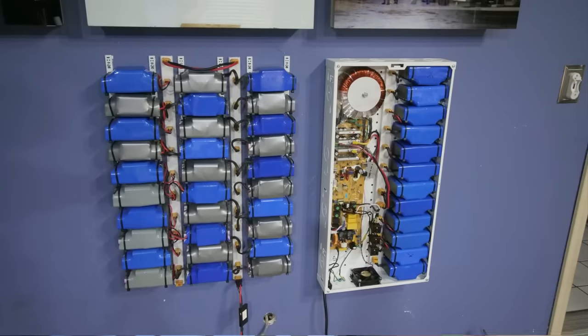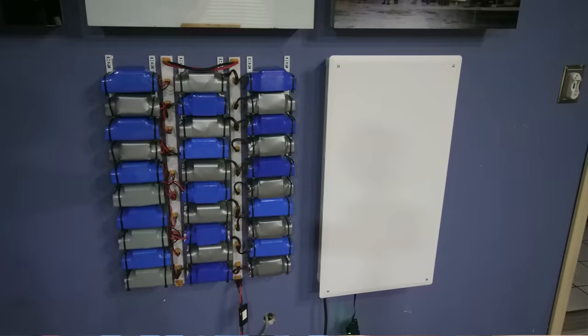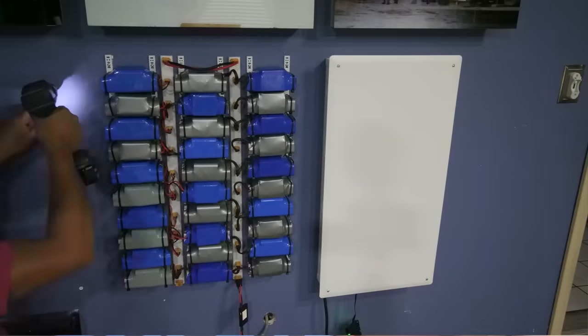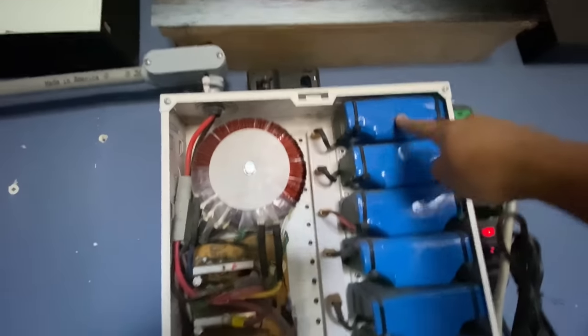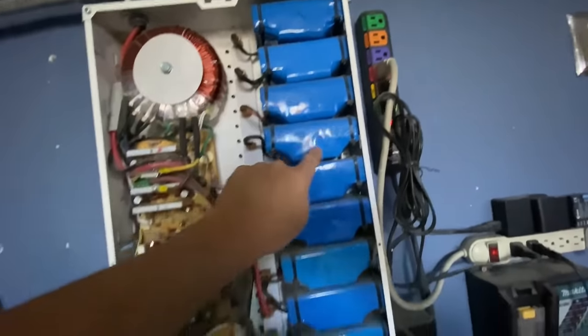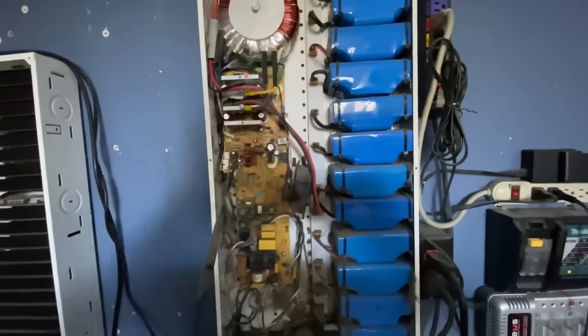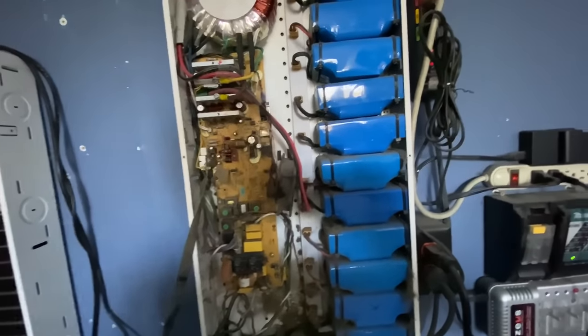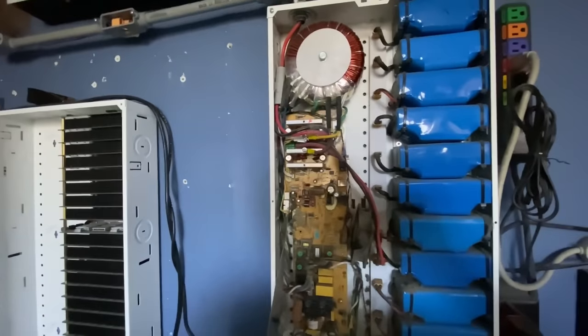You're ready to go — a backup power wall running on 36-volt batteries, whether these hoverboard ones or newer scooter batteries. Any 10S 36-volt pack will work with this unit. There's also an auxiliary output cable for an additional battery bank, which is what I used to connect the 30 extra packs next to it. All the parts are now available, and I have links to everything you need to build this.